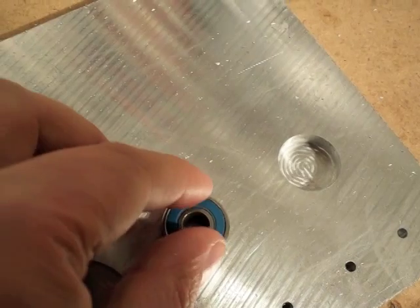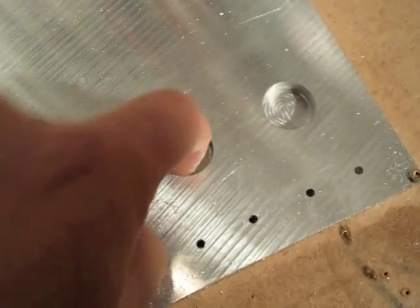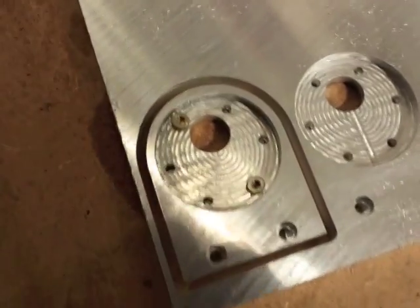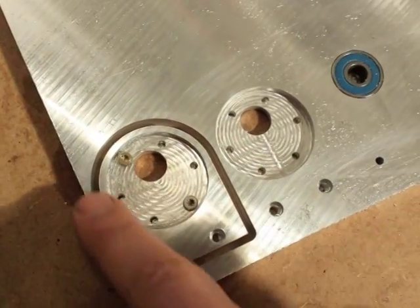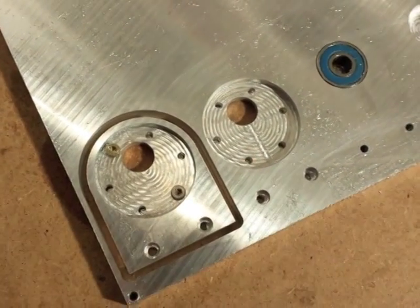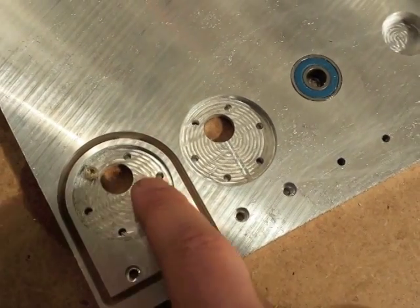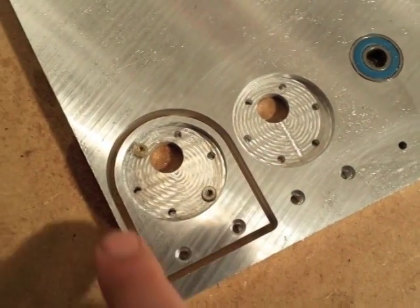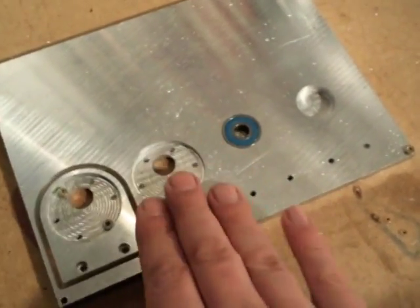You can see how nicely the system will work — the ball bearings go in here very nicely, very tight. This is the first holder part; it has been finished. When milling aluminum and doing the cutouts, you want to make sure you fix the part somehow on the table. Luckily in this case I had some holes already, so I used some screws to fix the part, and then it was no problem to cut it out.